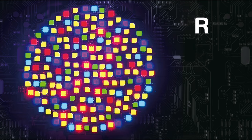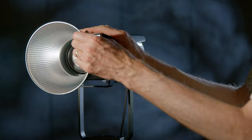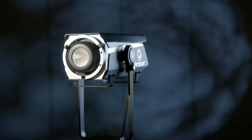I'm shooting it through a 4x4 right over here. The thing that's unique about this light is instead of using red, green, blue, and two different colors of white LEDs — tungsten and daylight — instead, this light uses red, green, blue, amber, cyan, and lime colored LEDs. No white colored LEDs in this fixture at all. On its chip-on-board, it has all these different colors, and then it shoots through a diffusion dome, which mixes them all.